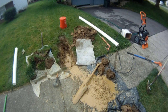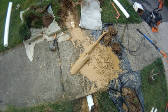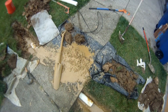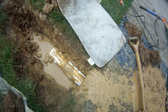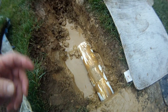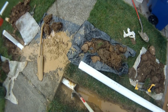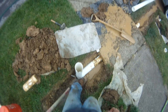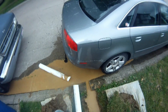It's about ready to come out the other end — you can see the sacrificial piece coming out. Tap it through; you can always use your rubber mallet if it's a little difficult to use your foot. I've got it about half and half there. Now I just need to take off this sacrificial piece of pipe. I've got it 90'd up out of the ground and I'm going to make sure the pipe doesn't move while we're installing it by the street — sticking a shovel behind it helps keep the pipe that's been tunneled under the sidewalk in place.